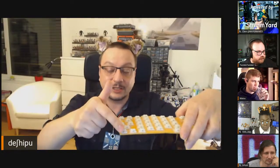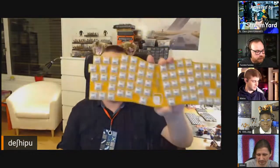Is that a native part of that design, or is that something extra you did? This is a design of this switch. It turned out that those switches are very crappy. The Kailh Choc switches are great. The Kailh Choc switches that are sunken into the PCB are super crappy. The problem is you get the click before they actually connect. Oh, that's not good. So you type and you feel that you are typing, but nothing. It didn't actually actuate. That's not good. So I abandoned this.